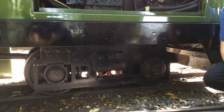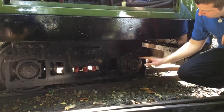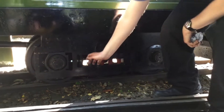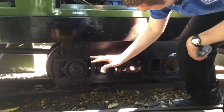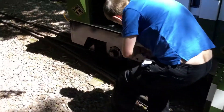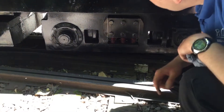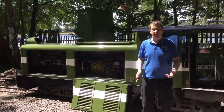So we've done all the top side of the loco. Now we've got to go around and check the underneath. These are the bogies with a wheel on each one — checking that the bearing is correctly greased, there's no damage in the springs for the suspension, the slack adjuster for the chain is all tight and not loose, and no other visible damage: anything hanging off, anything broken. I have to do these for all four bogies. Mainly just visual checks: slack adjusters, springs, correctly greased bearings. Then I go around and do exactly the same on the other side.